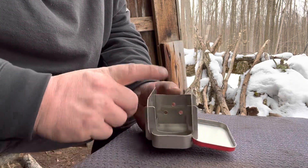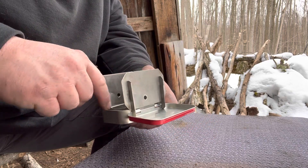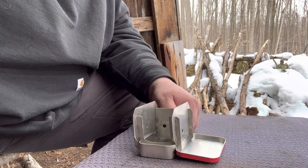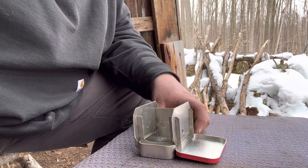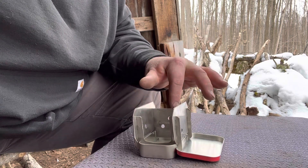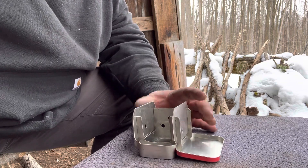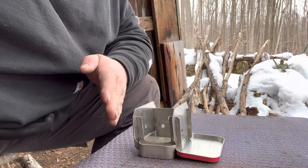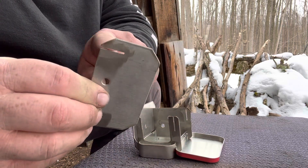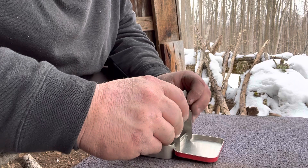You also have enough space from the top of the tin. The size of the bigger piece is the size of the opening of the tin container, which is two and one-eighth inches wide by three and a half inches long. The front and back of the stove are two and one-eighth inches wide by three inches long. When I used a right-angle grinder with a cutting disc, the disc itself is that size — so it's not like I cut extra; it's just the size of the disc cut into it. Some basic measurements and you're pretty much set to go.